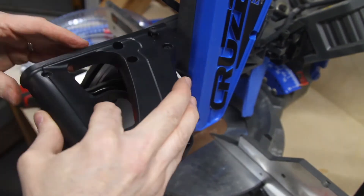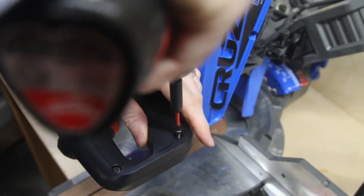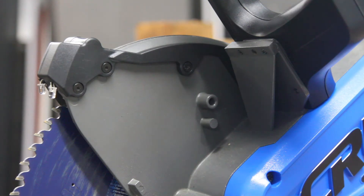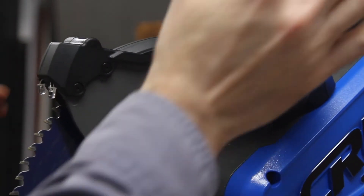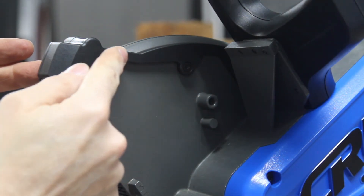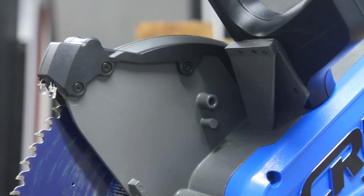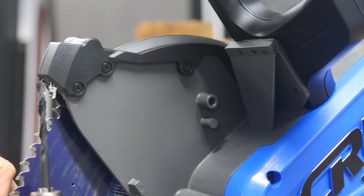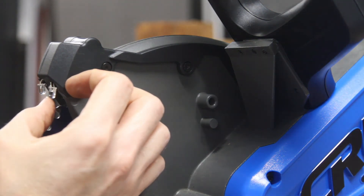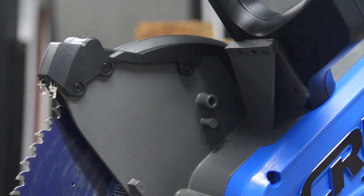Let's get it put back together and see what we've got — careful not to over-torque and strip anything out. What I had to do was take it back apart and pull the wire out because I needed to pull the LEDs out more — they weren't aimed right. When I had originally put that piece in the drill press and drilled the exact size metric holes for the LEDs, they were pointing too far out. So I had to re-drill at an angle, pull the LEDs through, and there's hot glue inside that holds everything. The LEDs don't shake or vibrate.